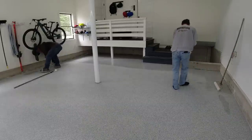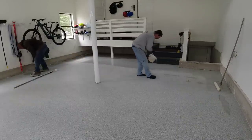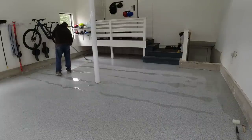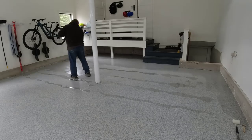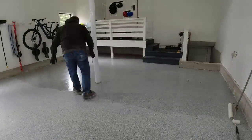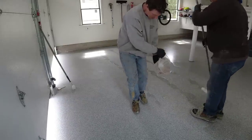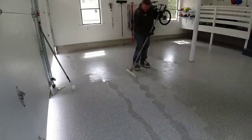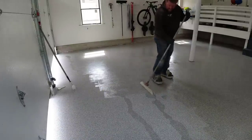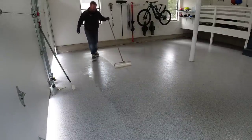This garage coating is going to wear for 15 to 20 years if maintained properly. That little knee wall — about 10 to 12 inches high — we give the owner the option to coat and flake that too. A lot of times we do, but this owner opted not to. It's an added cost since it's quite a bit more work to grind it and flake it. We had to close the garage doors quite a bit because the wind was really picking up and we wanted to keep as many leaves out as possible as we worked closer to the doors.